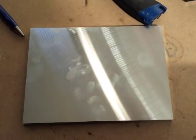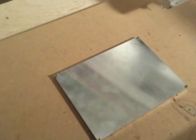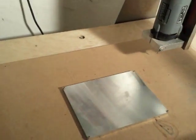The first step is to drill the holes in the corners, fix the piece on the work table, and start milling. As you can see, the holes are drilled and the piece of aluminum is fixed with some screws on the table. This is the usual way I fix my work pieces. This is the main work table, and on it I have a big piece of MDF — in Germany we call it an 'Opferplatte,' which means a sacrifice plate. Because this is always the victim: when you do some operations on the table, you will usually get some damage here on the sacrifice plate.